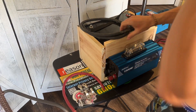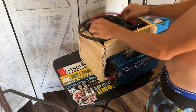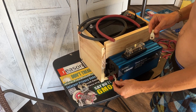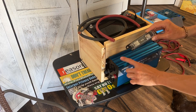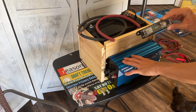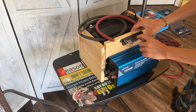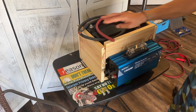Here's the wiring setup. I have a 1/0 negative cable in black — negative is always black — and a red 1/0 for power. I have ring terminals that go on the battery and also on the inverter. One important thing: we have to add an inline fuse on the positive side between the inverter and the battery. If something happens or there's a short, it will cut power and protect the battery. I'll mount the fuse holder here, and the positive side will flow through the fuse and over to the positive terminal.